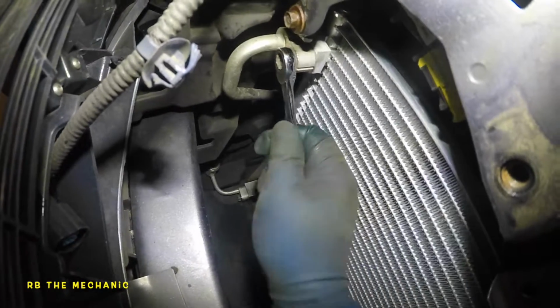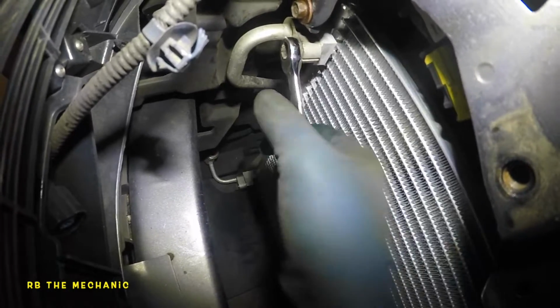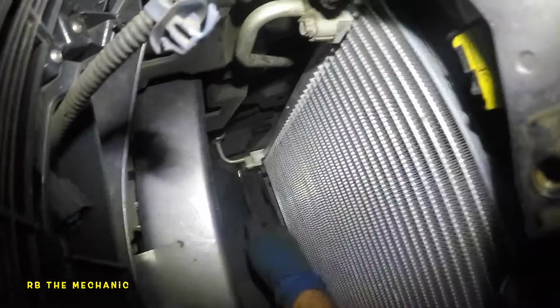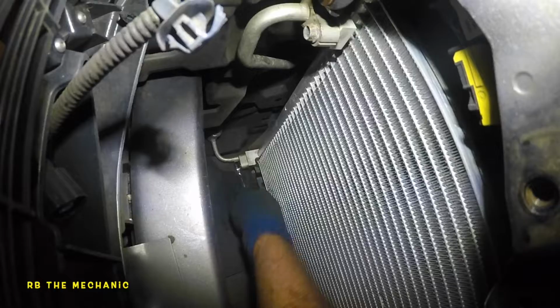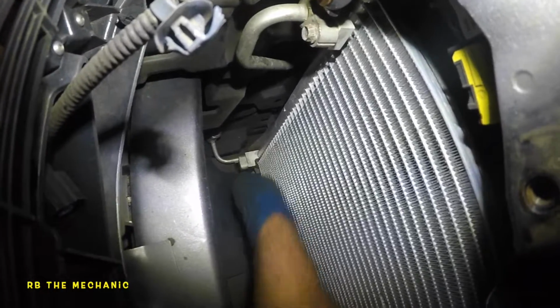Okay, got both line bolts in, nice and caught threads. So all I'm gonna do here is just snug it nice and tight. Okay, nothing crazy. You feel it nice and tight. That's it. Look where I'm holding the wrench. I could hold this wrench from the end. That's a lot of leverage. That means I'm gonna smack and break that little guy. So all I want is this guy tight.